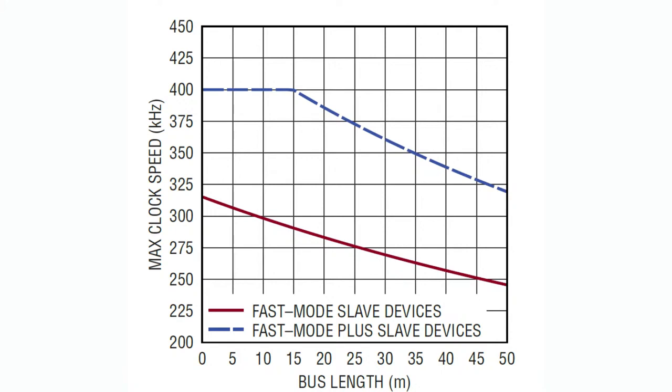Depending on the length of your cable, there's a calculation based on your twisted pair and capacitance that determines the speed/distance tradeoff. At 100 kilohertz you can easily reach 100 meters. At 400 kilohertz it happily runs up to 15 meters — and that's without any special tuning. If you use five volts differential instead of three volts, you could get even better distances.